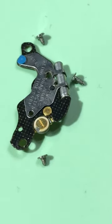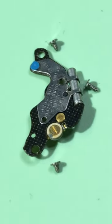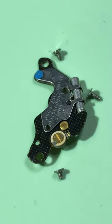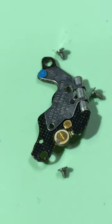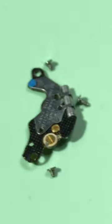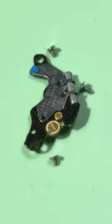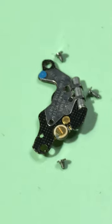The second hand is a hard click, one second at a time. It divides the 32,000-some-odd vibrations of the quartz — that's one second — and that's why they're so accurate, as opposed to a mechanical movement which beats anywhere from five to eight beats per second.